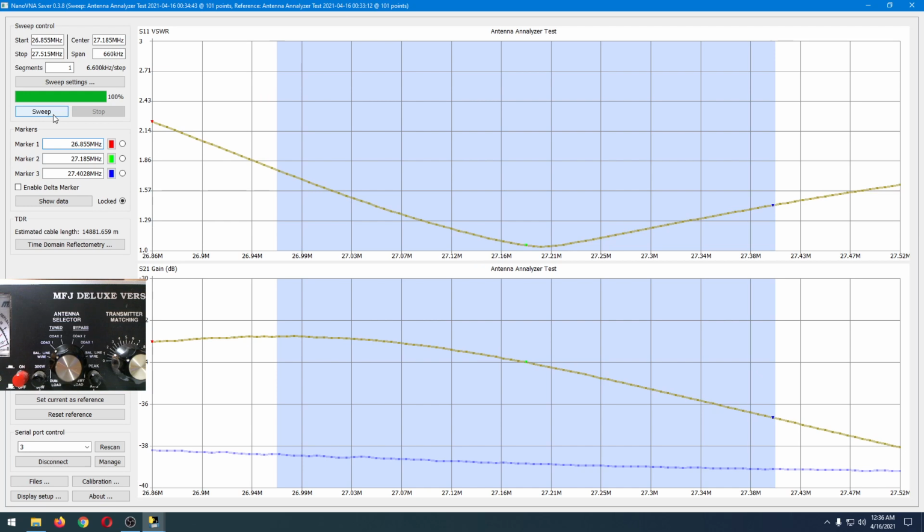On the right side, you see what comes to about 1 box worth of difference. It's a little more. We'll average it down to 1 box just for ease of calculation. 1 box, as I said, is 2 dB difference. 2 dB is, if I recall properly, around 60% gain over the original. So on one side we have 400% gain, on the other side we have 60% gain, simply because we used an antenna tuner.